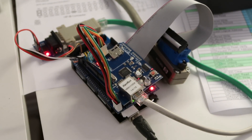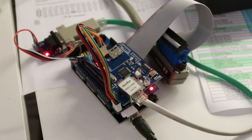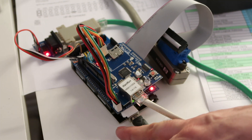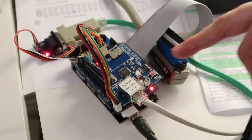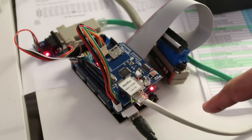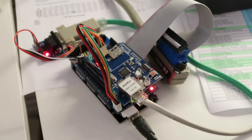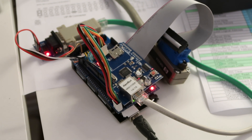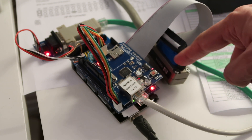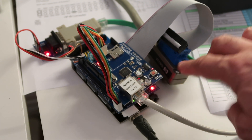This is the device, this is the adapter. It's made up from an Arduino Mega board, hiding at the bottom, a prototype shield, and an Ethernet shield which is connected to the network. The prototype shield below contains very few components: the two HPIB driver chips, an LS02 with a bunch of NOR gates, and a single transistor that drives the parallel poll. The HPIB bus is this flat cable connected to the traditional Hewlett Packard HPIB connector.